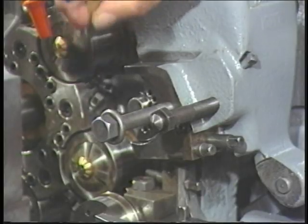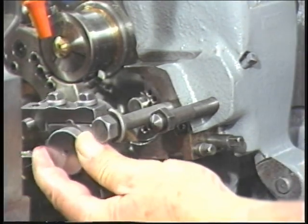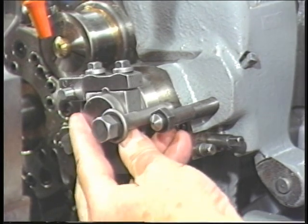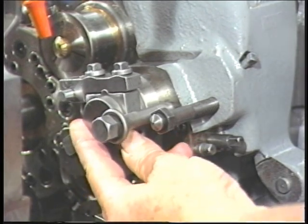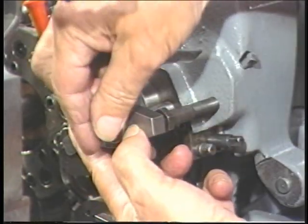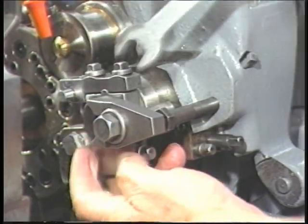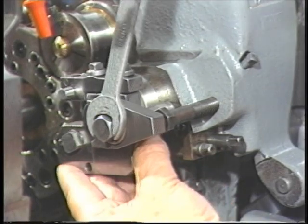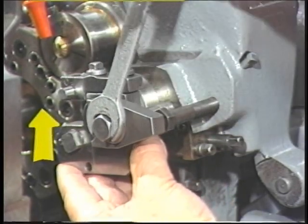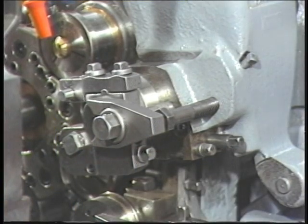To begin installation, clean the receiving area tool pocket thoroughly. The E2726 size tool holder is installed in nearly the same way as a form tool, with this exception: when tightening the clamping screw, lift up the front of the size tool holder and hold it up while tightening the bolt. This eliminates any possibility of backlash and also maintains the same amount of roll pressure, which is very important in maintaining the size of the workpiece. Check to be sure the spring float is still obtainable.